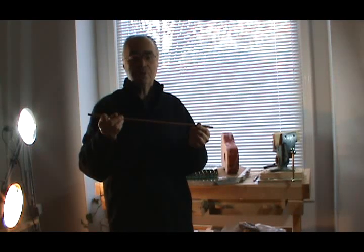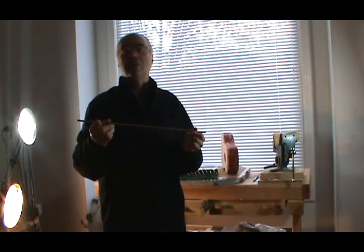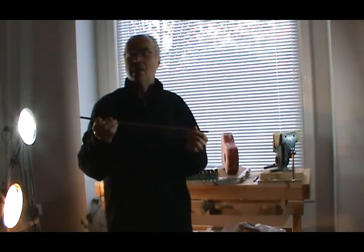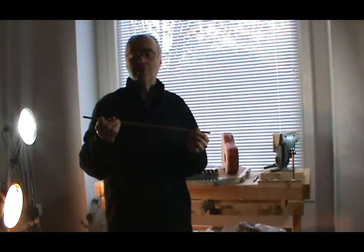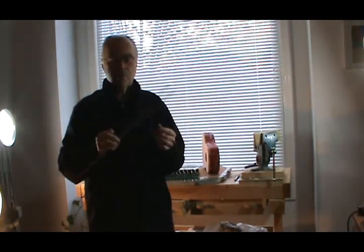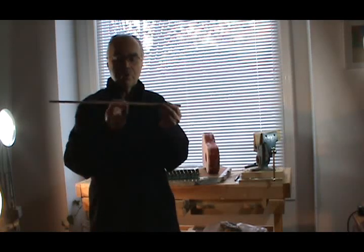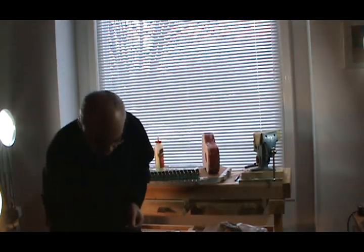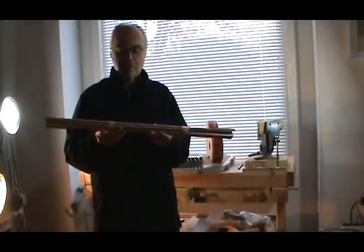Typical open grain woods are mahogany, which sometimes works okay, depends how dense it is. Oak, locust, ash, all those open type pores in the wood are difficult to use for purfling and banding, and I don't recommend you use them. Cherry is good if you can find some straight grain cherry.